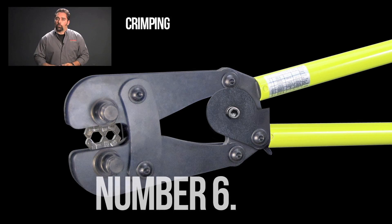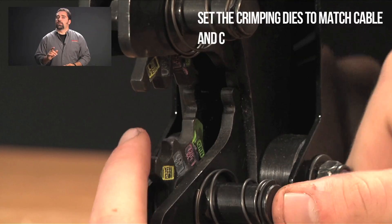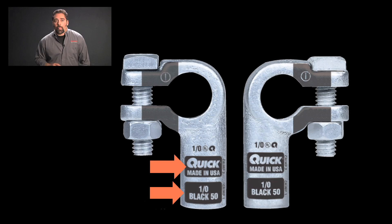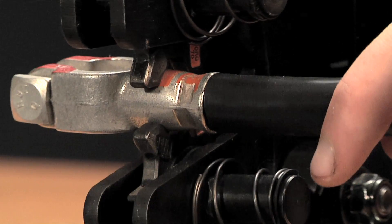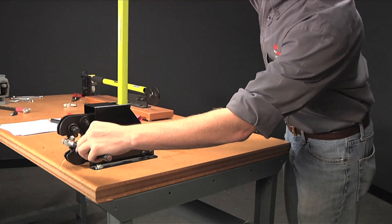Now it's time to crimp. Remember, regardless of what type or brand of crimper you are using, they will all have die settings. Set the crimping dies to match the cable and connector gauge and style. A four gauge max lug like this will need to be set differently than a four gauge quick connector like this. Place the connector in the dies at the end of the barrel for the first crimp. Most connectors can be double crimped and are marked for crimping location. Be sure to make a full crimp — the crimping tool should fully close or cycle. An incomplete crimp will likely not hold the cable in place.